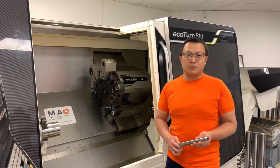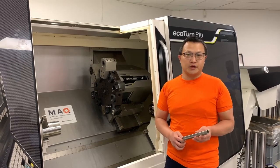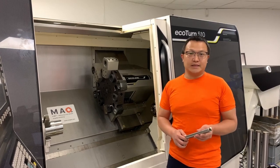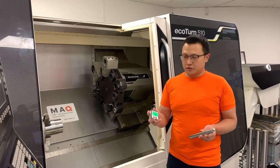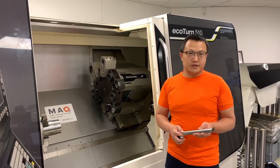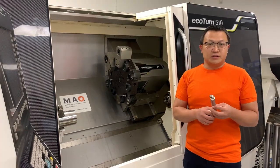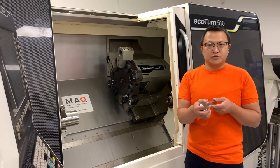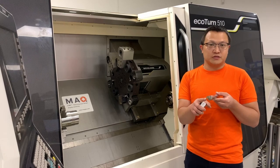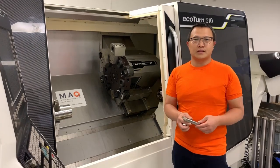Thank you for watching this video. Many people send us the question asking how to align a cutting tool from MQ into the turning machine. We're going to show you how easy it is to set the angle with the protractor from MQ and how fast you can settle the alignment. The alignment of the turning tool into the turning machine is quite important because you want to make sure that your cutting edge or cutting point is right in the middle of the workpiece, so that you have the cutting conditions, the forces, and so on, very well under control.